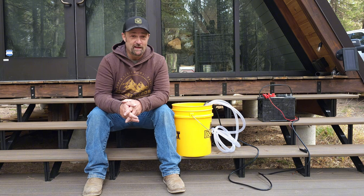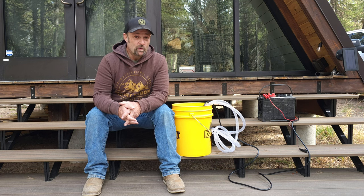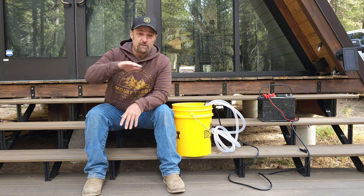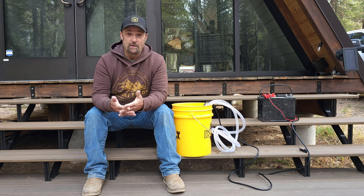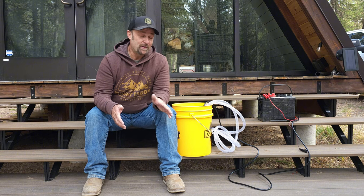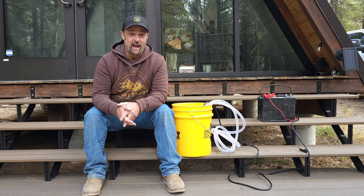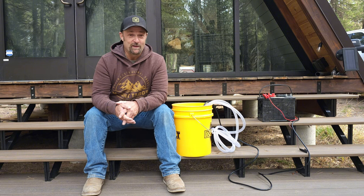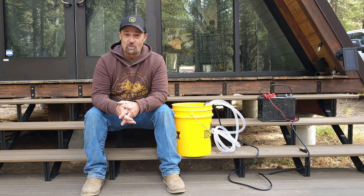A little bit about our well: we just had it drilled, and they drilled to 304 feet. We got a flow of 7 gallons per minute and a static water level of 88 feet. We're planning on dropping this down to 125 feet and using it to just top off a tank. The next step up for a pump that will work for us out here is going to be in the $2,000 range, and then it just goes up from there. So I'm looking at a couple of different options in case this one doesn't work, but if it does, I'll be under $400 to have a pump installed with all the parts and everything.